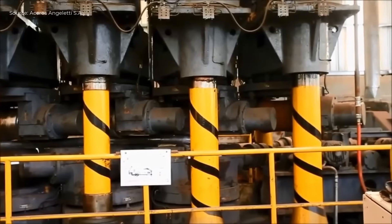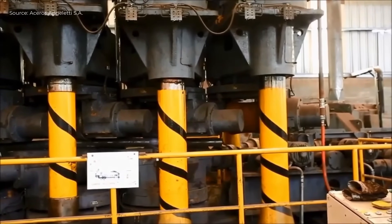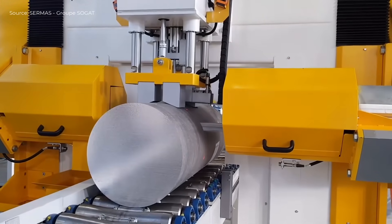Finally, the finished rolled steel — either as bars, billets, or flats — is ready for dispatch. The high-speed band saw cuts aluminum billets with full automation. Billets are fed into the saw, where the blade advances at 1.8 inches per second. A 12-inch diameter billet is cut in just 11 seconds.